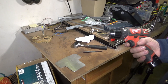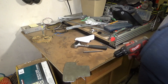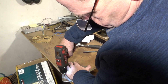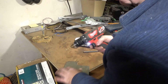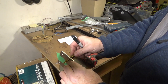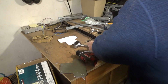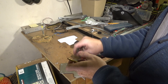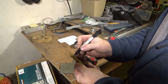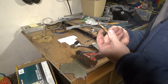Here's the drill — eighth inch drill bit in it. That's a good hole, although if memory serves this isn't a very great drill bit, but we'll see how it does. Normally I'd just drill into my work table countertop, but this is my CNC table so I don't really want to do that. Here's the step drill I'm going to use — it's got nice thick steps so the eighth inch aluminum ends up with a solid diameter drill bit instead of being halfway between two steps. I'm going to take the Sharpie marker and color the flutes we need to get to — that way as the drill bit's going around we should be able to see it and know when we've gone far enough, and we'll slow it down a little bit.